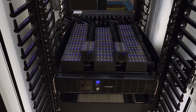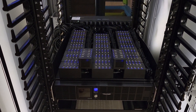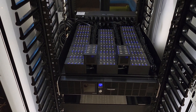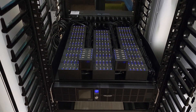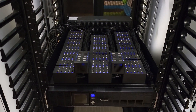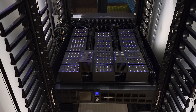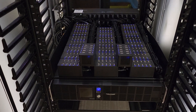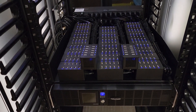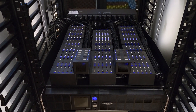That 20-amp breaker is feeding the battery backup. The max draw on the battery backup is 1675 watts. A 20-amp circuit can supply around 2400 watts, but safely I would not pull more than 1900 to 1950 watts. So 1900 watts off a 20-amp, 110-volt circuit is my personal limit — that's roughly 80%, which leaves me a bit of headroom to power a few other things.